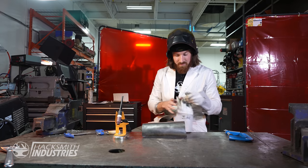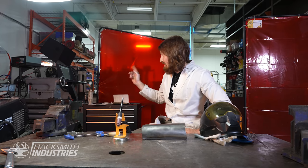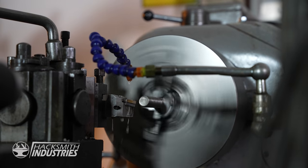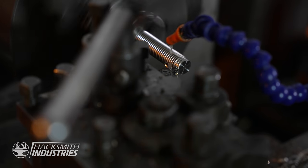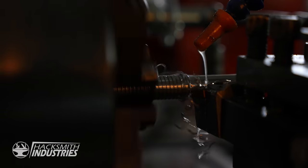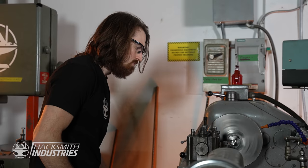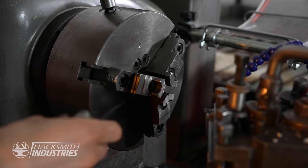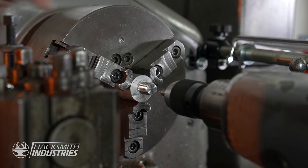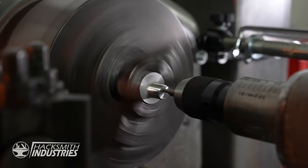All right, that's the easy part. Now, we need to make our patented launching mechanism. And for that, we're gonna need to use the lathe. So for our launcher mechanism, we actually need an offset hole in this piece right here. So I've actually made an offset jig for it, which looks kind of funny when you turn the lathe on. It's working.